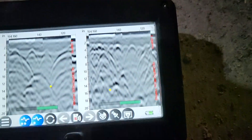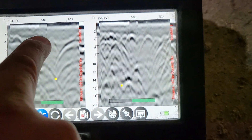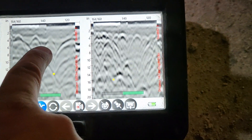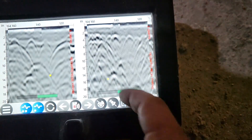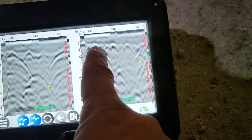Alright, check this out — here's another example of the grade beam. Here's the beam, and here are two rebar responses in the beam, or two responses indicative of supporting rebar. They're harder to see over here because they're embedded in a wire mesh.